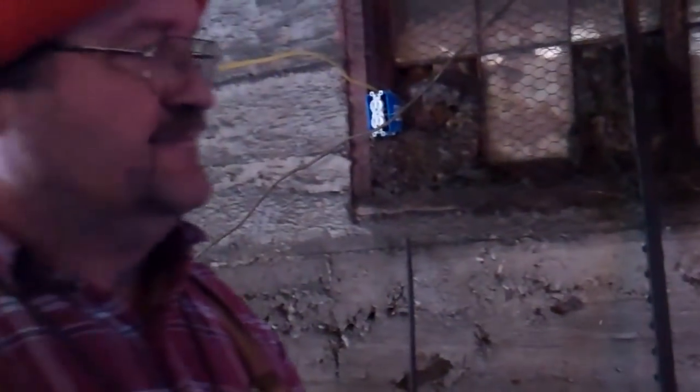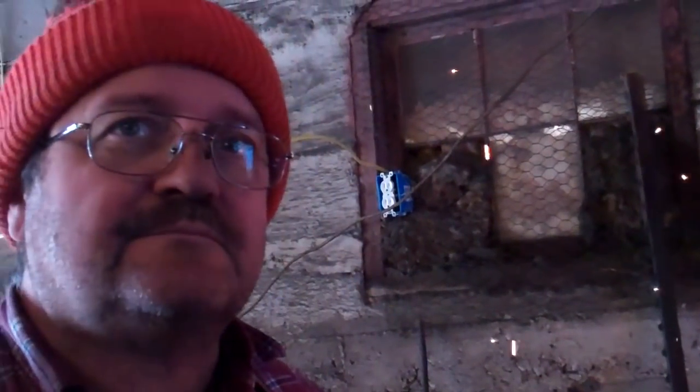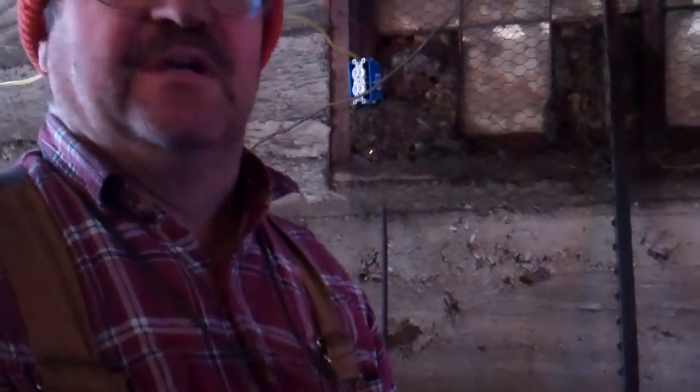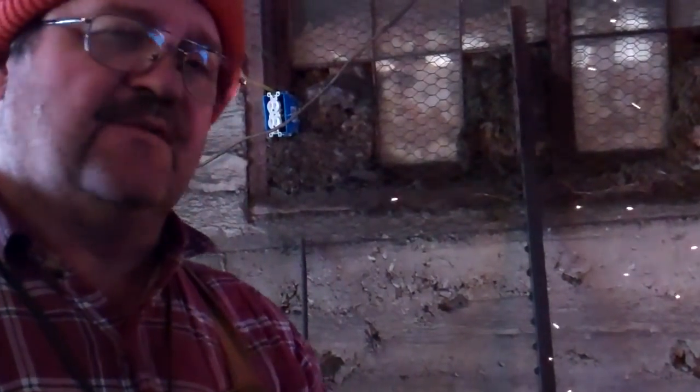So let's say you get your steel and you forge it flat and fold it over, get all the impurities out of it, and all these sorts of things. Have you ever tested the steel that comes out of here? Sure. Of course you have, but I'm asking, anticipating that you have an answer. In what respect, though? Because I've got hardness testers, micro hardness testers. What is the closest commercially available steel to what you're able to produce? Well, you can vary the carbon content, but probably something between 1084 and 1095.